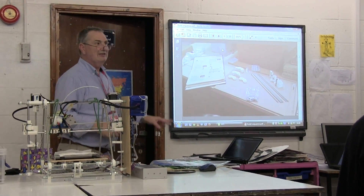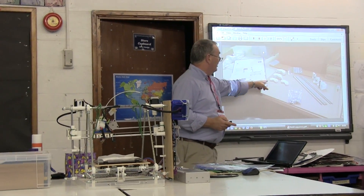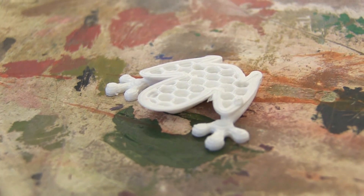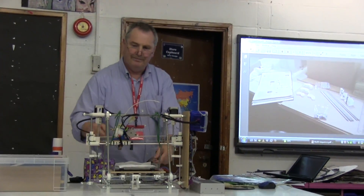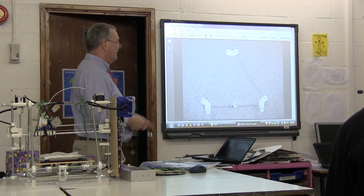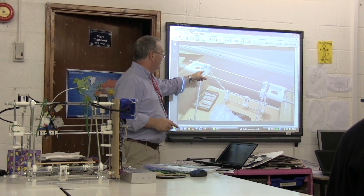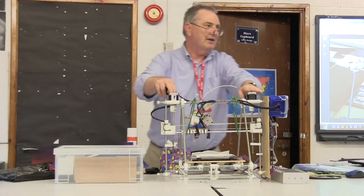This is an overview of the process to build a printer. The plastic sets the framework and structure of the machine while the metal forms a major part of the frame. You start by making one side, make two of those to get both sides, then connect them together to form the z-axis. The two motors sit up there and drive the z-axis, making the base go up and down.